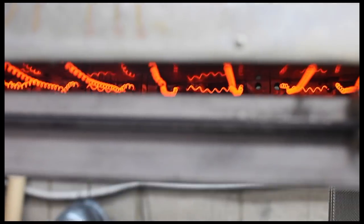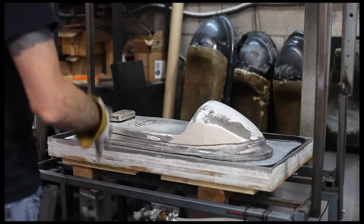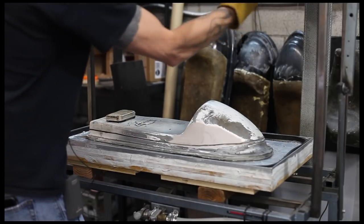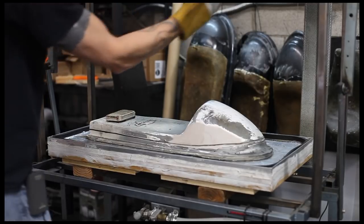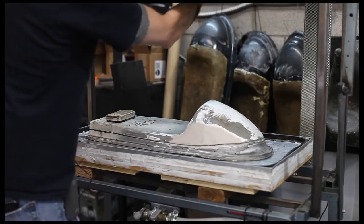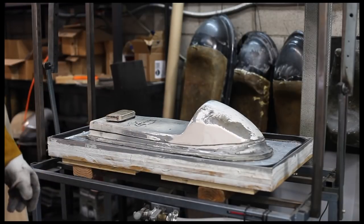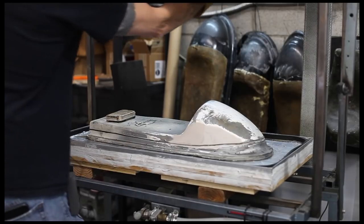So let's give it a couple of minutes. The heater's on — it's going to take 5 to 10 minutes to warm that plastic up to forming temperature. In the meantime we're going to suck all the air out of our vacuum tank. My plastic is almost ready. When it's ready it's extremely pliable. Just got to make sure we don't have any hard spots in the corners or we're going to leak, and we need a tight seal to suck all the air out of that big tank.